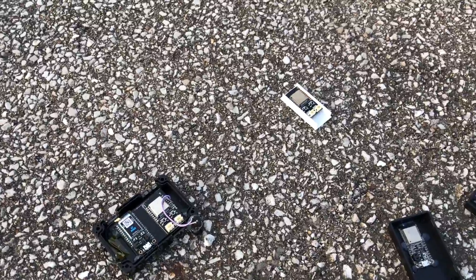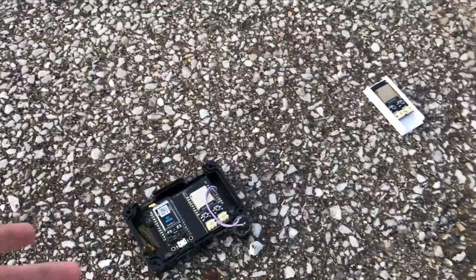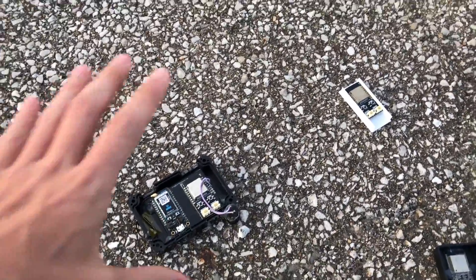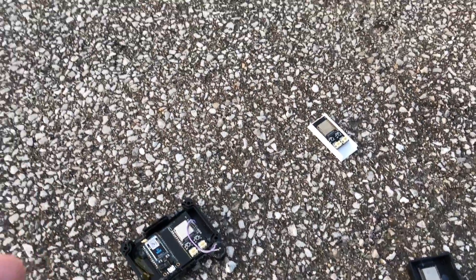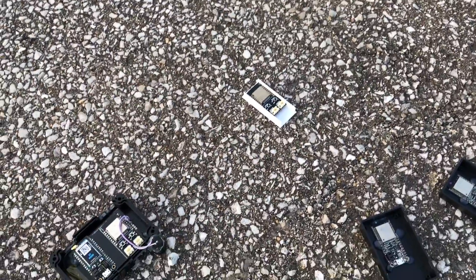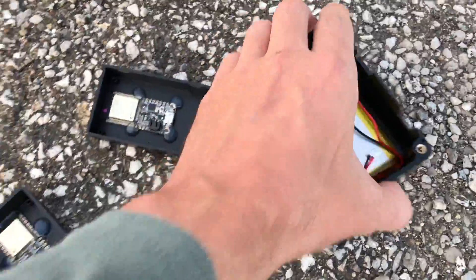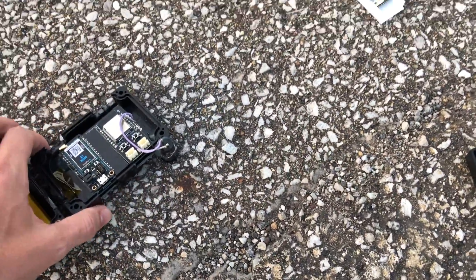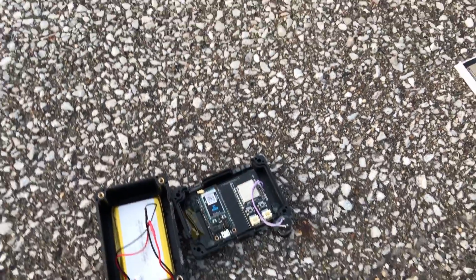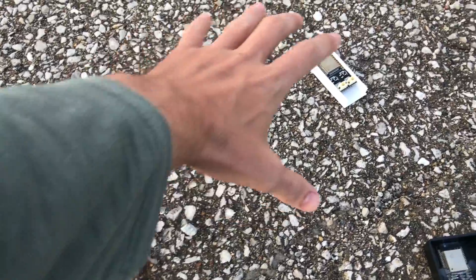What I want to do out here today - and this is kind of cool because this system is all local. It doesn't require any internet access or existing Wi-Fi network. It's all self-contained. And the best part is that everything can be battery powered. The Trigboards are battery powered, but even the gateway is battery backed. I want to see what kind of range I get from this out to the Trigboards, since the ESP32 is acting as the access point.